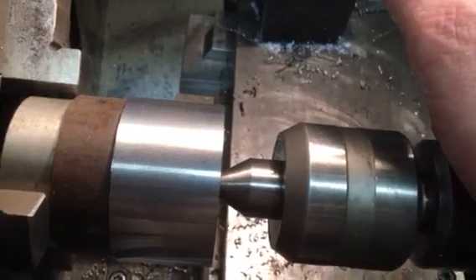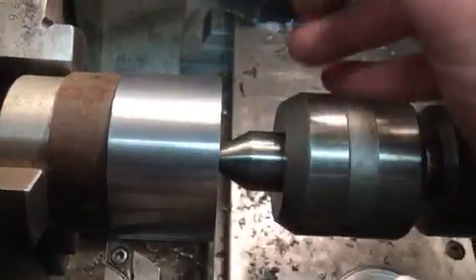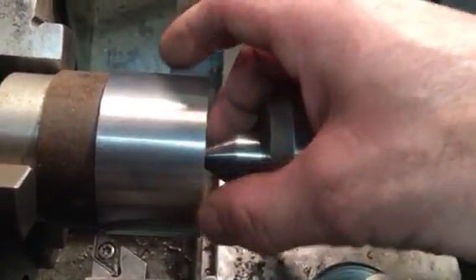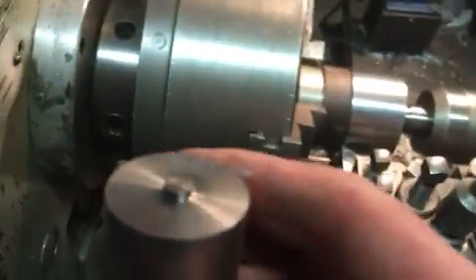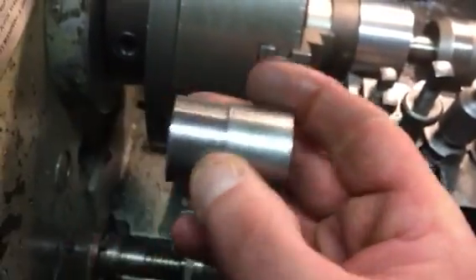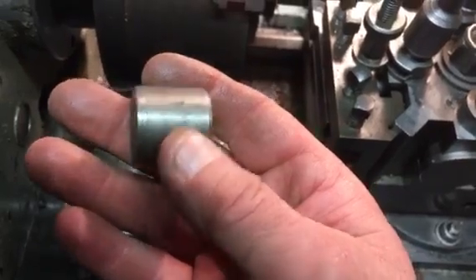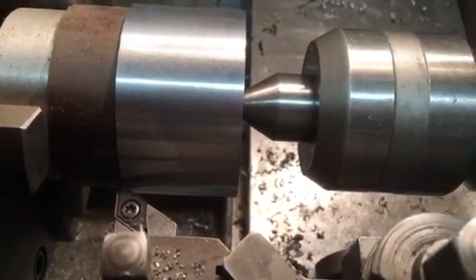So there we have it — that face is nicely cleaned up, ready for the rest of the machining. That is pressure turning: very simple and very quick for turning over the outside of a piece of bar. You won't end up with steps and you don't have to turn it around in the chuck. You can also stack multiple pieces, and if they have a hole you can put spigots on the ends to locate on, then pressure turn them. The pressure pads are relieved in the middle to ensure good clamping force on the components. Thank you very much for watching — I hope you've enjoyed this short video on pressure turning and found it useful. If you have, please subscribe to my channel.